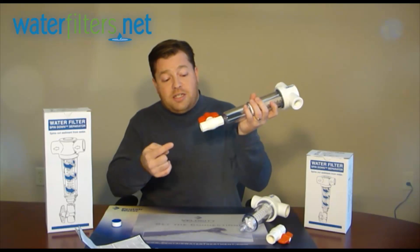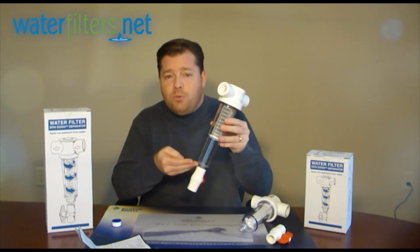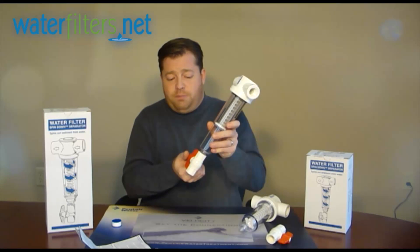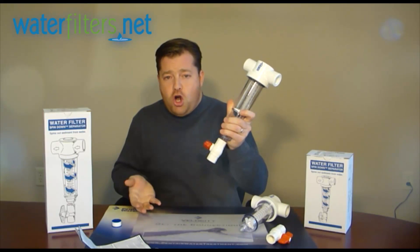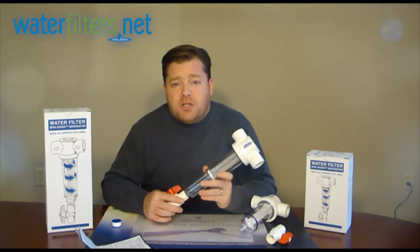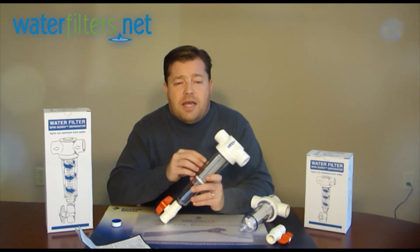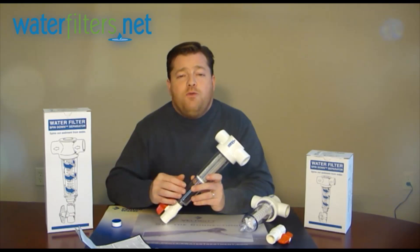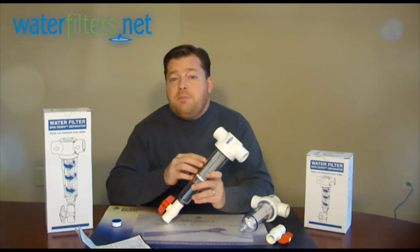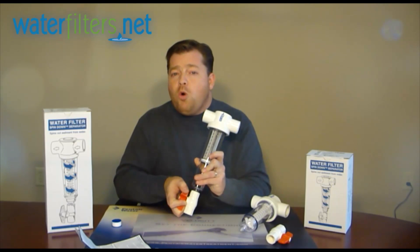You've got your valve, and you can attach a hose to it or just leave it open. Every now and then the trap will fill up and the element will collect some crud as well. You simply open the valve and purge the crud out of your filter system. In some cases, if you're filtering out fine particulate and you have a very fine element — like the 1000 mesh, which is equal to 15 microns, the finest available — that element is probably going to need to be removed periodically and physically cleaned. The purging probably won't be sufficient.